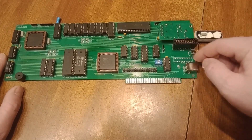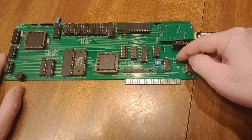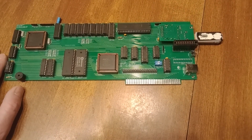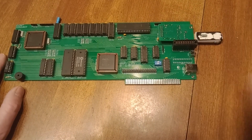The slot has address 0 through 7 and data 0 through 7, IO read, IO write, and interrupt, and chip select, and then power. It's kind of mapped — I meant it for a parallel port or a serial port mostly, but you could do whatever there.